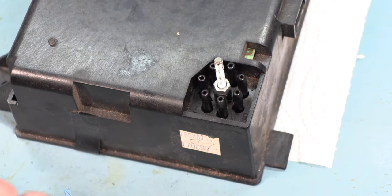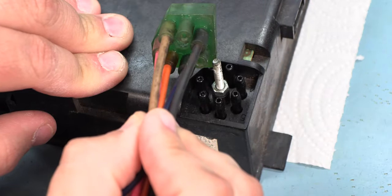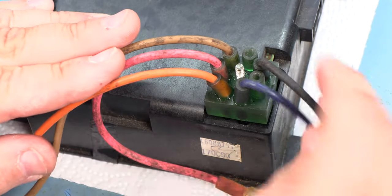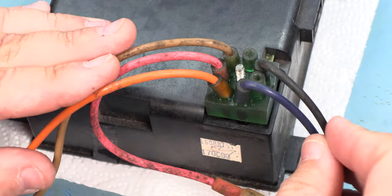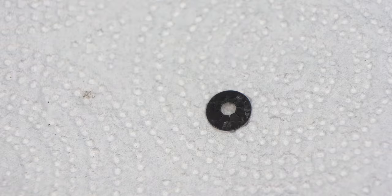As we can see there's a metal post protruding up from the center of the vacuum port. Notice the chamfered corner at the top left of the vacuum block — it attaches in this orientation. When we press that firmly in place, we'll see the metal stud protruding from the top. The way this attaches is with a washer, and then this one-way push-on nut goes over the center of the stud to hold everything in place.